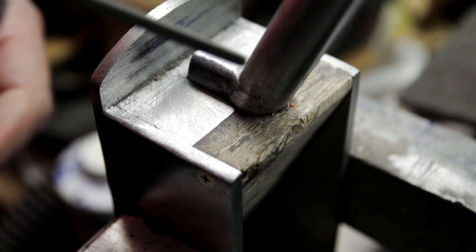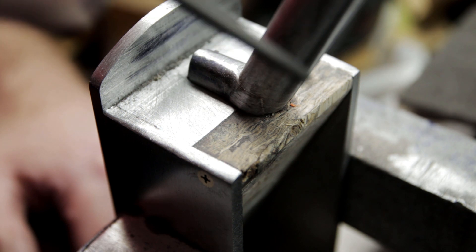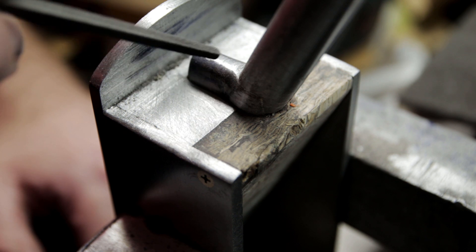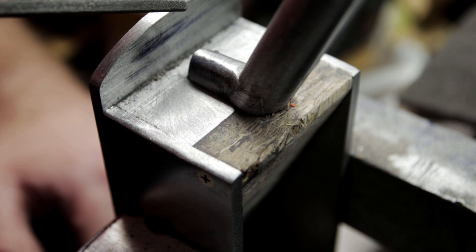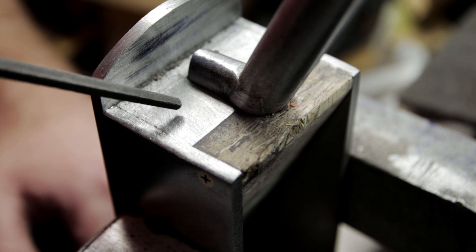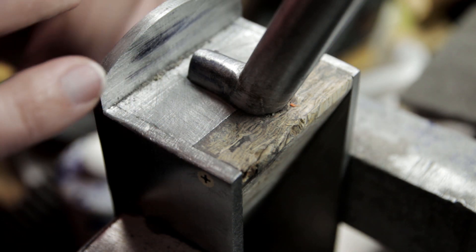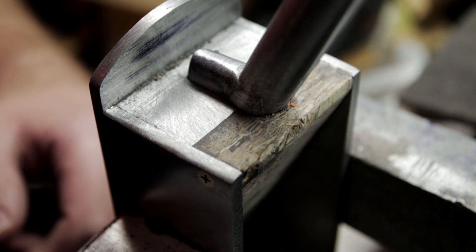I think I'm going to try doing — I can't remake this piece because it's epoxied and riveted in, and that would be a giant mess. This won't come off, which I really should have cleaned up before I installed this piece. The only way to get that off would be to drill it out, and I don't want to do that. So I'm going to fill this with some wood putty, smooth it out, go over the whole area with some fillable primer, work out some of these scratches, and then just do a little bit of paint on it. I think I can make that look interesting, so we'll see what happens.